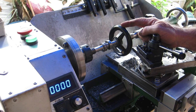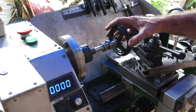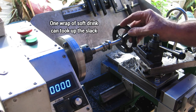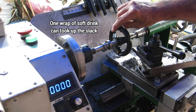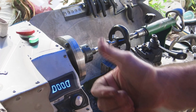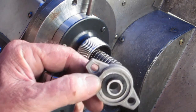I just got this out of the pack - it's the new one I bought to replace the one I broke. Have a go at this - that hole in there is nearly 12.3mm. This is 12mm - well, 11.97mm - but look at that gap. I'll have to shim it or something, that's hopeless. Oh well, too late to think about it now and I thought another one could end up with something even worse than that anyway - onwards and upwards.